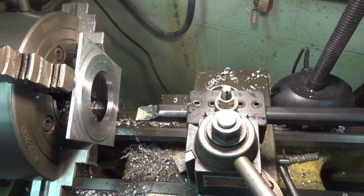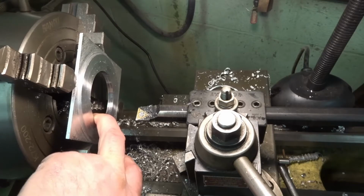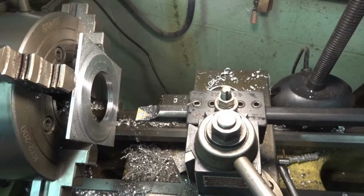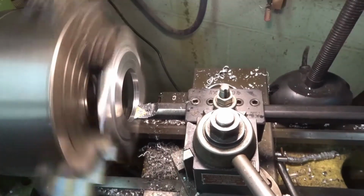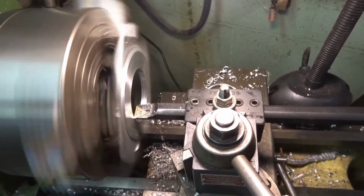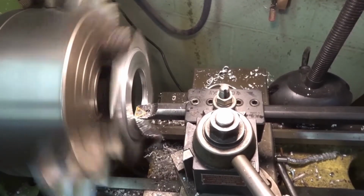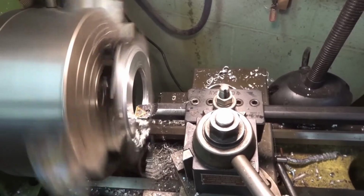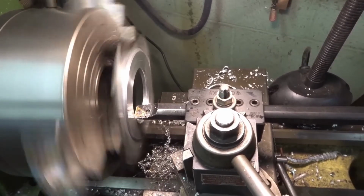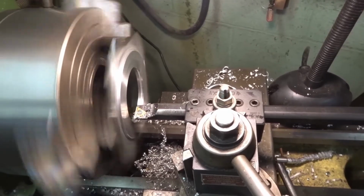Okay, so after doing some measurements here, right now this hole is at 2.52, and we need to make that lip 2.72. So 200 thousandths has got to come out of there. That's pretty light, really. Here's 100 thousandths, and I may hand feed it purposely, because we don't need to go that much depth here. Alright. And the other 100.